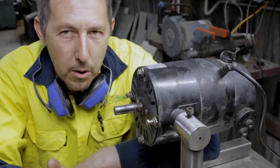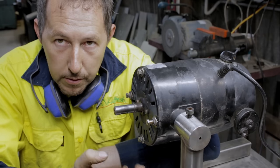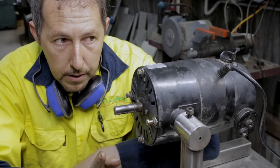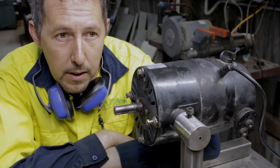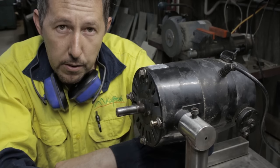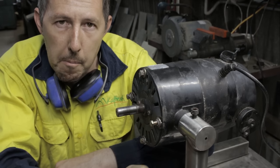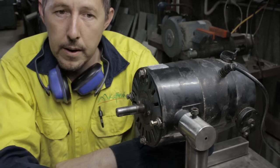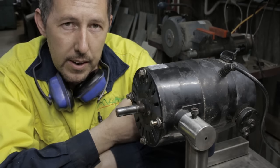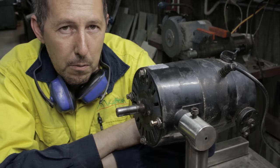Hey Steve, couldn't you make the rocket stove furnace work in such a way that it wouldn't actually need an electric motor? Couldn't we just design the furnace so it could passively power itself? Yes, we could do that, but it would be a pain in the butt to use. You'd be constantly having to remove the riser in order to feed it more aluminium to smelt. I have seen guys do it and it is totally doable, but the stove becomes massive at that point. In order to have enough draw to pull enough air through, you require a very large insulated riser, and basically I don't know if I have that much room to spare down there.